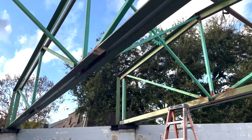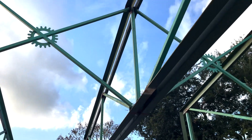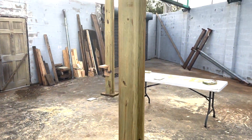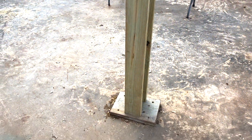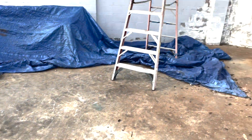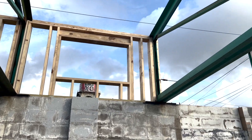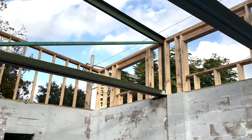We've got all the trusses up now and we have fabricated these X braces to go between the trusses. We've got these temporary columns here which will eventually be replaced by steel columns, but before we get to that we're gonna have to cut out the concrete. We're gonna cut a big square here and then pour a massive concrete footing beneath the slab. In the meantime we're working on framing — you can see we've begun framing in these wall sections, and we've got to get all of these done in the next few weeks so that we're ready when the roof panels arrive.